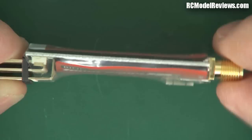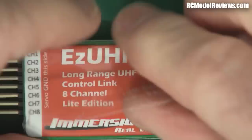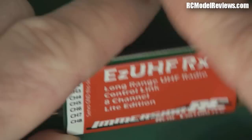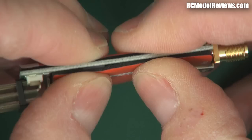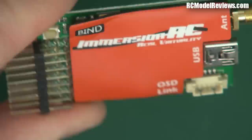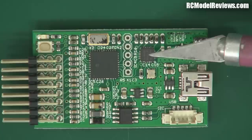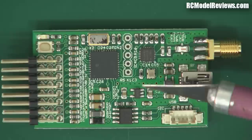Like the Shearer, it's a very thin receiver - everything is just mounted on a board; no big coils like the old long-wire systems. We need to take this heat shrink off to have a look inside. There's a sticker actually stuck to the board, and under that there's foam padding protecting the board from damage - probably not a bad idea. I'll peel this off-camera so I don't break anything. There we go - all the goodness under that little foam pad. We've got that same Silicon Labs chip - the Si4432 - same as in the transmitter.